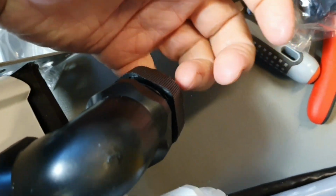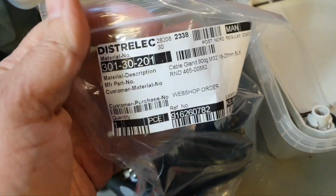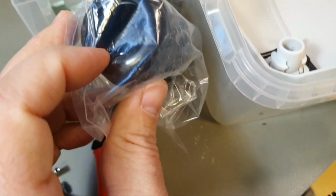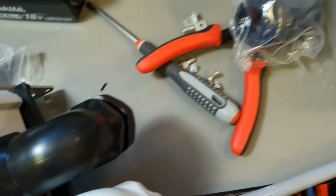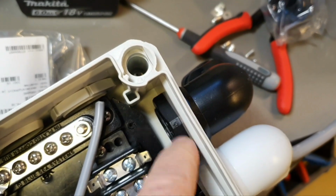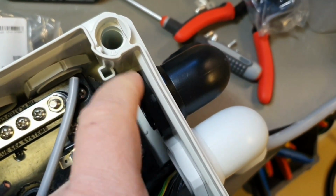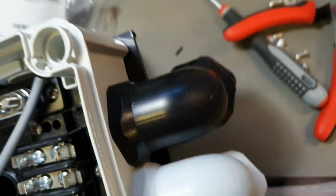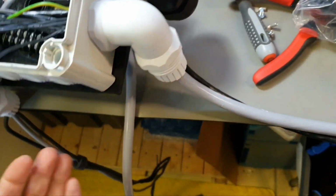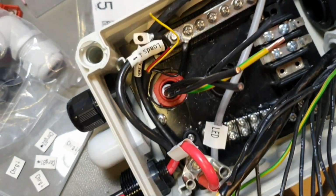And here I actually need a 13 millimeters pipe, but fortunately these 90-degree cable glands do have another sealing ring that is fine for the smaller diameter. Otherwise it would be a problem to fit an M25 or M20 sealing solution here, because the hole is too big. M32, and that direction is native for the pipes that will come from the floor there. You will see when I start to install this to the board.